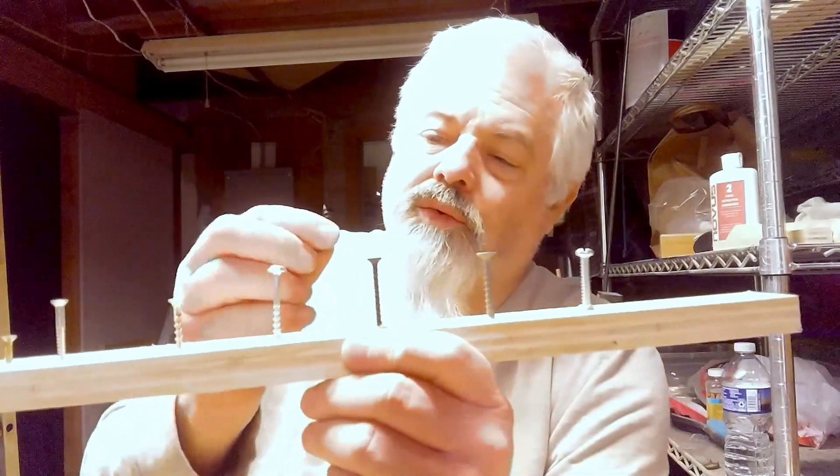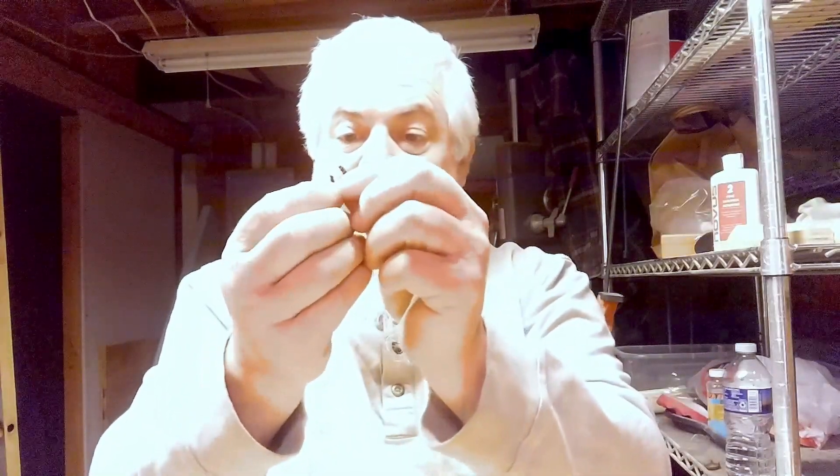However, when you're dealing with shearing strength — what I did is I took this drywall screw, put it in a vice, hit it from the side, and it bent. And as you can see, I only had to get it to a certain point and it just basically snapped away. It's come apart really easily. That has to do with bending and shearing strength. It's not designed for use on, say, a chair in an area where the tension on your wood is perpendicular to the screw — that shearing strength is just going to break it over time or loosen it up.